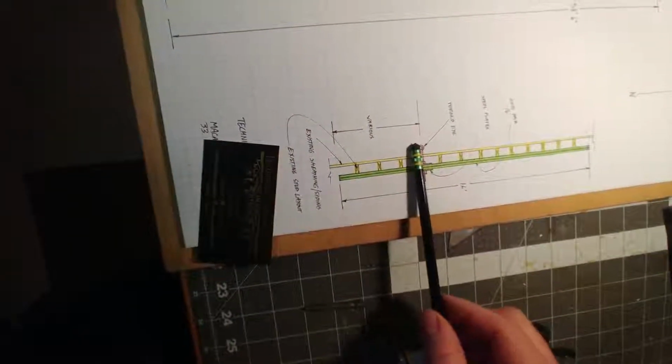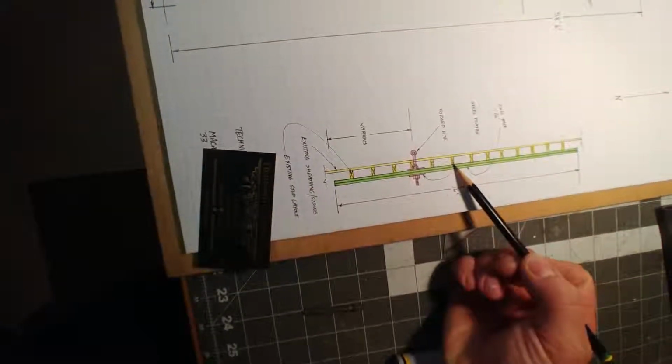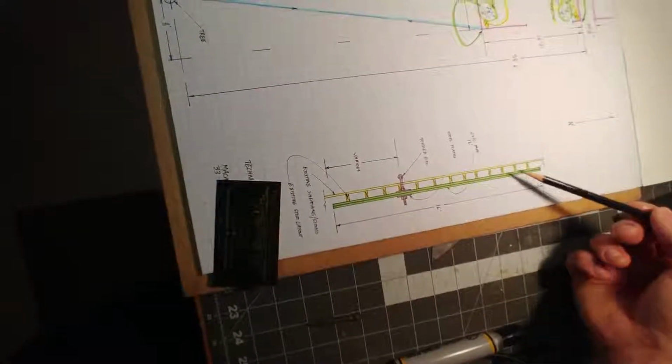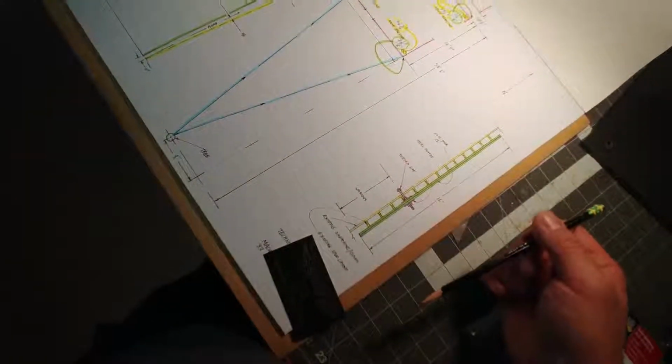And we'll make these locations work out right alongside a stud location. I would rather not pull and potentially bow a little bit into the wall bay. If I can help it, we'll pull right alongside a stud. That'll add some more integrity and relate more to pulling the wall out. But the idea that lumber, and maybe even multiple locations at the same time, would entice this to move and not damage anything here, and we would just end up with some 1-inch diameter holes in the wall that we can go up and put a little sheet metal over, the thin sheet metal patch, and roll it out the same color as the siding, and you just never know that we had been there.